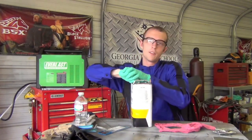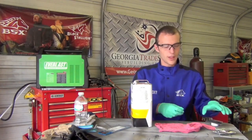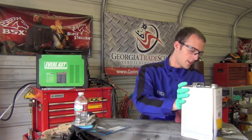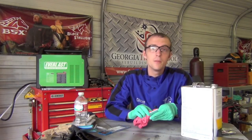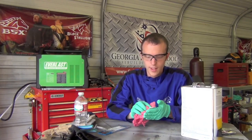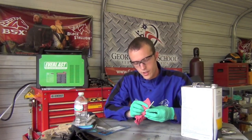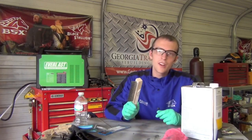When I clean aluminum I like to use acetone first before wire brushing, simply because this way we're removing contamination without brushing it into the material. You want to be careful not to wipe around anything on the aluminum. This particular aluminum is a remnant I picked up from the local steel yard so it's pretty clean, but I'll go ahead and wipe it down with acetone and then wire brush it.